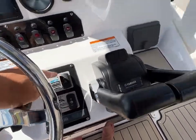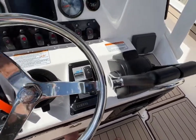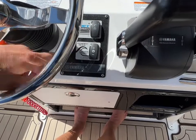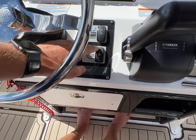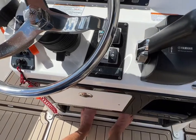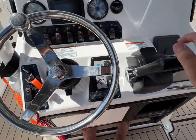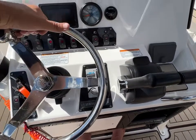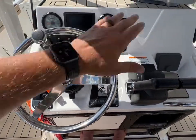This thing also has a jet wash on it. The connection for that is right over here in this corner. There is a hose and things in the live well to connect to with a sprayer so you can clean this thing out if you need to. Then you've got the cruise assist and no-wake mode. Whenever you're cruising through the no-wake zone, you just hit that plus sign and it will take you in half-mile-per-hour increments up to, I believe, five miles per hour. It's just like a cruise control for no wake — it keeps a consistent speed without you having to worry about it. Same way with cruise: if you're surfing and want to run at 10.5 miles per hour, push forward until you're going 10.5 and hit that plus sign. That puts it into cruise control, locking the engines at that exact speed so you continue at 10.5 miles per hour, and all you have to do is worry about steering.